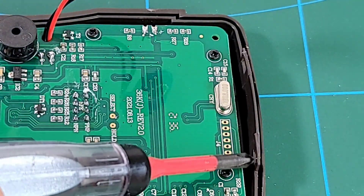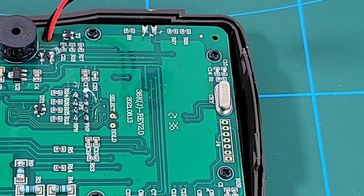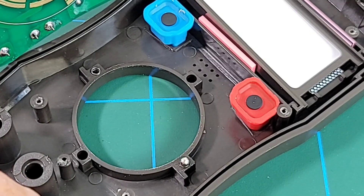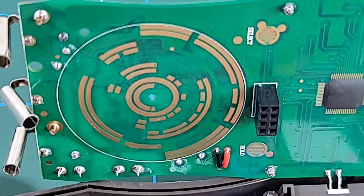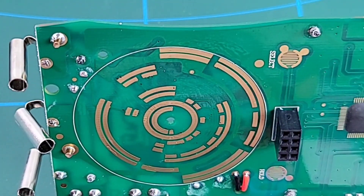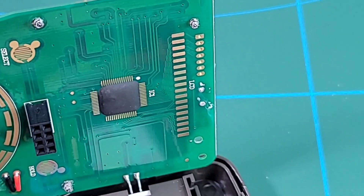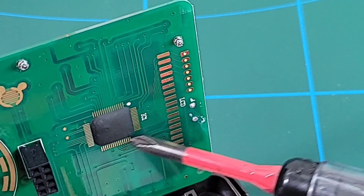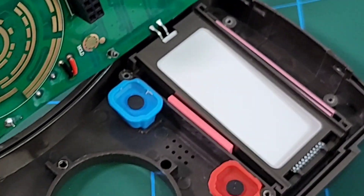NCV would have made this the complete package — just saying! On the other side of the PCB: soft touch buttons, a zebra strip for the backlit LCD display, and the rotary selector tracks with a tiny bit of grease — really nice to see. The other side of the input jacks shows excellent soldering — good sized blobs, no cold joints whatsoever. The HFE transistor slot is there too. Main IC is a COB — a little unusual to be on this side of the PCB, but all in all looking good.